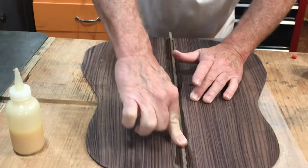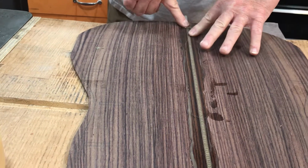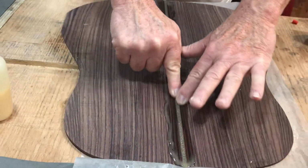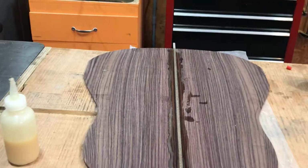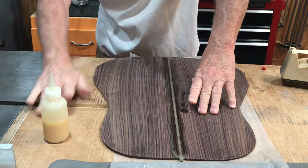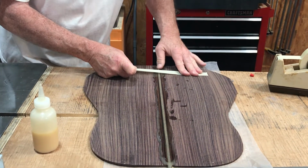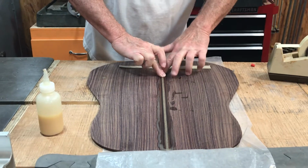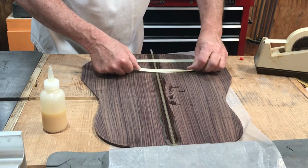And what I'm doing now is using my fingertips to go down through and make sure that all three of those surfaces line up evenly. All right, and it seems like it's together well. Let me grab a paper towel here to clean up a little bit. Now, once you have everything lined up well, and that's one of the reasons you want a nice flat surface to do this on, so everything lines up well. All right, now we start taping this side the same way. And as we work our way up, make sure that the back joints are lining up.